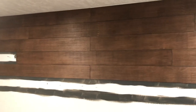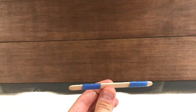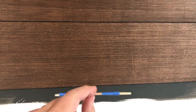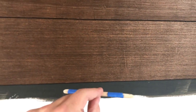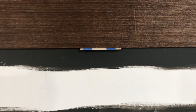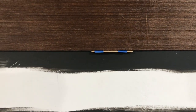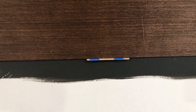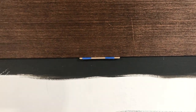You can see it's coming along pretty nicely at this point. I'm working from the top down in case it's uneven at all — at the bottom, that can be covered up with the baseboards. I've used a lot of different things as spacers when I've done paneling or shiplap-type projects in the past, and the best thing I've found to use are just plain popsicle sticks with some painting tape wrapped around it backwards. This allows you to just put the stick up there and it'll stay in place nicely as you hold and nail the panels. Makes life a lot easier than using a coin or something else.